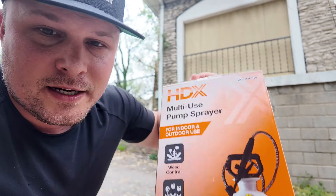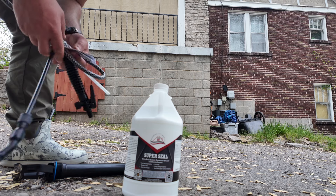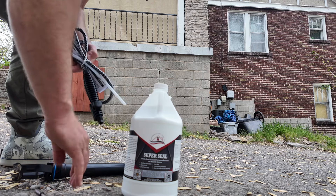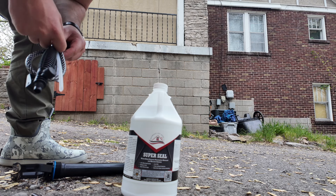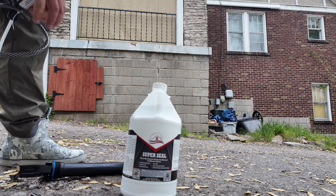When you're sealing, I always like to use a disposable sprayer. I have used sprayers in the past that have pumps on them — there are a couple of companies that make sprayers that go on top of a five-gallon bucket. The only issue with those is with sealant, depending on what kind you run through it, you really got to clean it out, otherwise that pump inside is going to be kaput and you'll have to replace it. And if you don't soak all the fittings, personal experience, you get to the next job site and it will start spraying all wonky. Now you've got a whole day devoted and 10,000 square feet worth of concrete to seal and your sprayer is messing up — that is crap. So with small stuff, I always like to use a disposable sprayer.